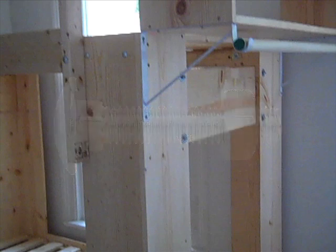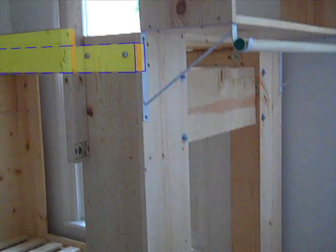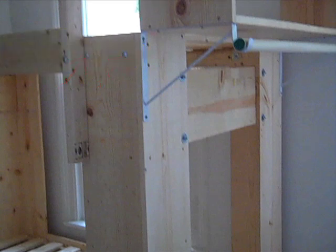For the bunk bed, three things get bolted together. The 1x10 braces are fastened with quarter-inch by 2-inch carriage bolts. The 2x4 beams that support the planks under the mattresses are fastened with 5/16-inch by 3-inch carriage bolts. The top rails of the ladder and the other 2x3 post holding the 1x6 guard each get a single 3/8-inch by 5.5-inch carriage bolt that goes through the long dimension of the 2x3 rails as well as the 2x4 plus 1x6 composite beam.